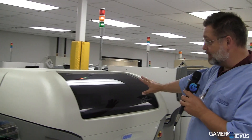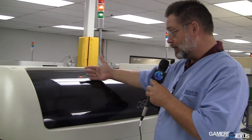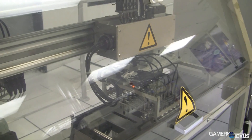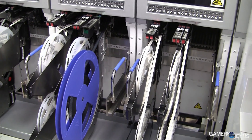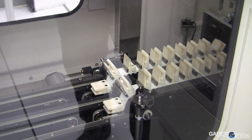The first machine has a large metal stencil. This is what a stencil typically looks like — there's a bunch of holes that are laser cut into it based on whatever that particular board's requirements are, and we put this into the first machine. The first machine will then apply the solder through the stencil onto each of the boards. The second step is verification using a solder paste inspection process where we use a laser to read the solder positioned on the boards and verify that the proper amount is on there — not too much, not too little, just enough to have the highest quality.